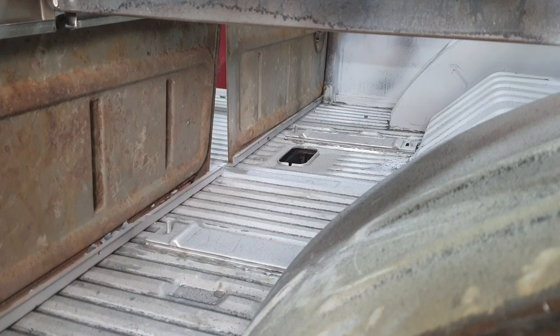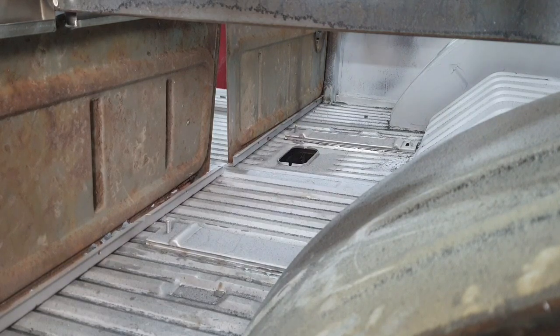So I got a half inch and half inch bend on each side. So I got to go 2 inches wider than that, and then it's 11 and a half tall between those two areas. And then I need an extra inch on the bottom and an inch on the top. So 11 and a half, so 12 and a half inches. Better make it 13 just to be safe. All right, so I gotta cut the piece out like that, and then I'll bend it up and make that piece.